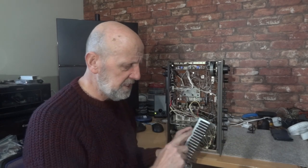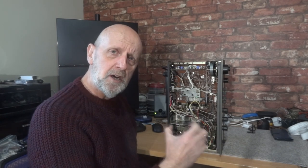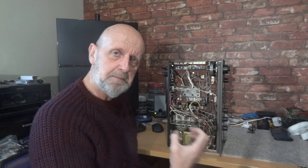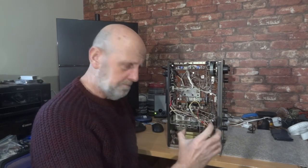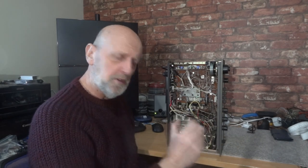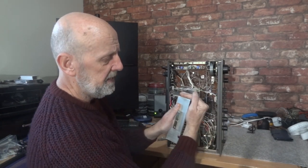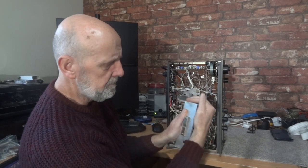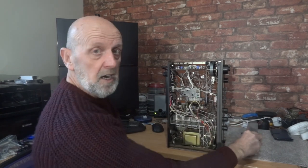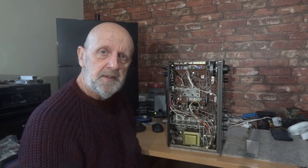That's something to do if you can see a gap in your fins. But on this particular transformer you can see the black fins have no gap — the glue or varnish holding them together is still in place and working fine. What I'm going to do is put some epoxy glue between the inner core of the transformer — the fins — and the outer casing. If there's a slight gap it causes vibration, and the glue between them will hopefully get rid of it. Let me show you the video of me applying that epoxy resin.